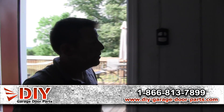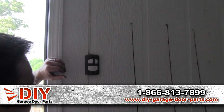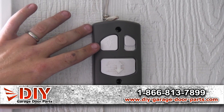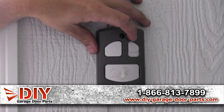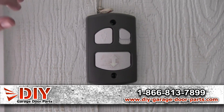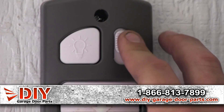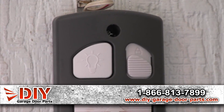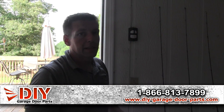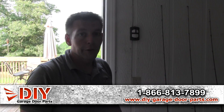On the wall station, sometimes you'll just have a single button to raise and lower the door. If you have a wall station, generally you'll have an up and down button and a light function where you can turn the light on and off manually. Usually there's also a lock or security feature — on Genies it'll be up top, on LiftMasters it'll be towards the bottom. You can activate it by holding for three to five seconds or flipping a switch, and what that does is disable all wireless devices — remotes, outdoor keypads — so if you go on vacation, nobody can break in with another remote.